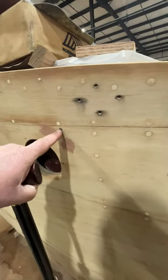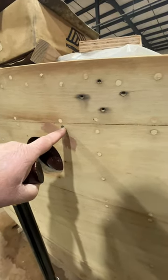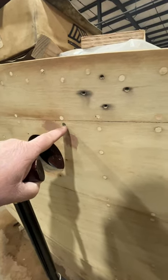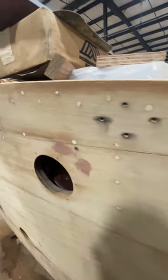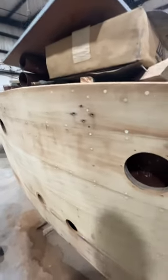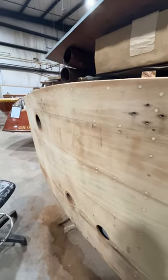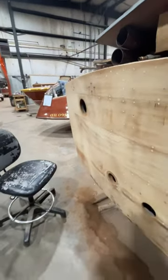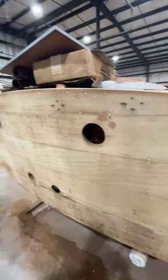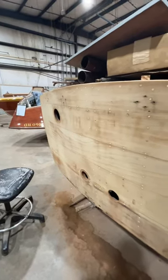What we're going to need to do is clean the filler out, pull the screw out, and then drill it deeper. This is a 5/16ths hole and the countersinks will be 3/8ths. We're going to bung this — the bungs are much prettier when varnished than the filler would be. Anyway, I wanted to tell you that's what we're doing, and we'll get the varnishing started here this week.